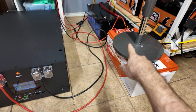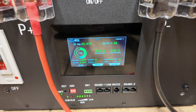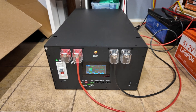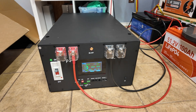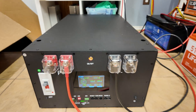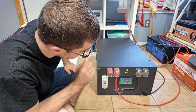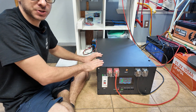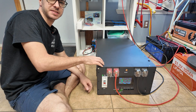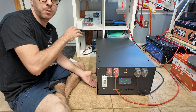We've got the Ying Jing battery completely commissioned and hooked up. We have six-gauge wires running in parallel with two golf cart batteries — not ideal but just wanted to get it running. As you can see, it's charging because the cells were probably a little under 50% for storage. It's been charging for about a day, we have a ton of sun today, and the battery is pretty much fully charged. You get a lot of capacity for the size of this battery. The cells are Ying Jing brand, brand-new Grade A according to them — we'll see how long they last.